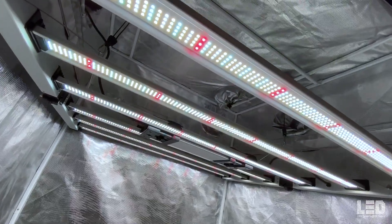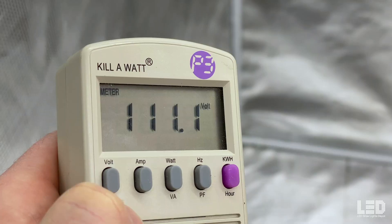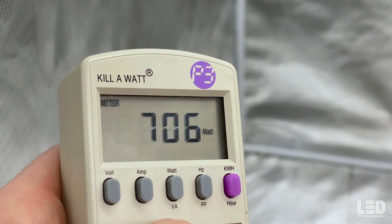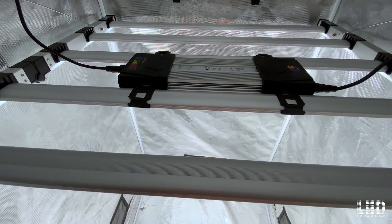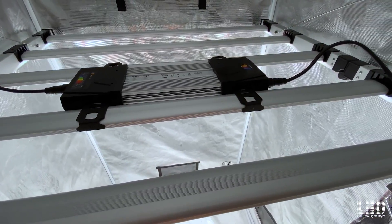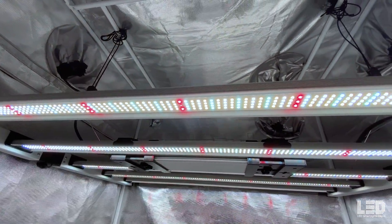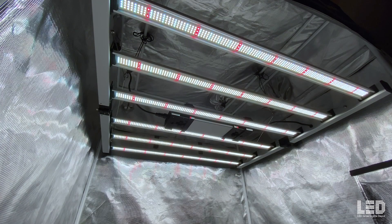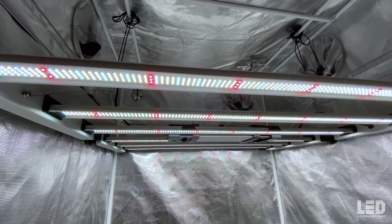This fixture draws 680-Watts according to Mammoth Lighting. I measured the wattage and amperage at 111 volts and received a reading of 705 watts at an amperage of 6.37. I tested the light shortly after I turned it on so the wattage was a little bit higher than it would have leveled off at. NEMA 515P 120V and NEMA 615P 240V plugs are both included. The total light output is reported by Mammoth Lighting at 2,006 micromoles per second with a high efficacy of 2.97 micromoles per joule. Expect a heat output of 2,320 BTUs per hour from this fixture.